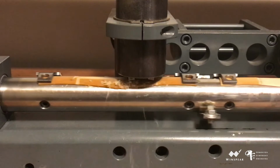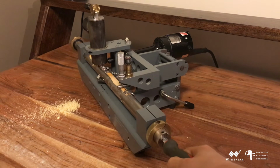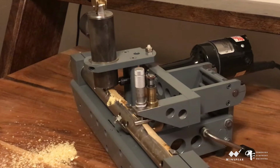Since the cutter, which is the blade that removes material, moves in tandem with the tracing rod, the machine actually copies the contour of the template to the piece of gouged and shaped cane that needs to be profiled. I first rotate the barrel a quarter of a turn to the left so that it passes under the cutter from collar to collar. Then I'll make an eighth of a turn back to the right to integrate the work that I've done on the previous pass.